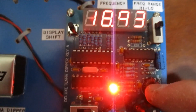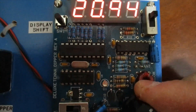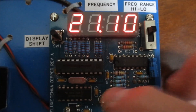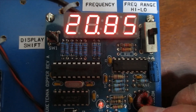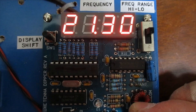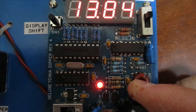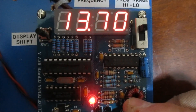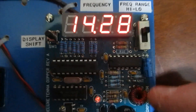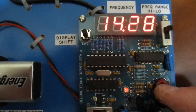Let's flip the frequency range switch up. We're at 15 meters — look at that, the SWR is right down. Good bandwidth; I'm right in the CW portion for 15 meters. Let's go down to 20 meters. Very good — I'm a little high on 20 meters, but it's definitely 2:1 or under. That light's not very bright at all; it looks a lot brighter in the camera lens than when I look at it directly.